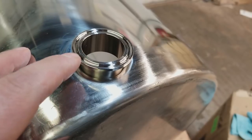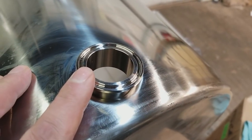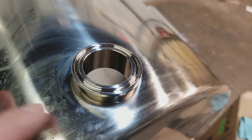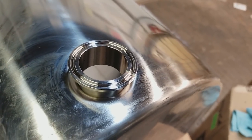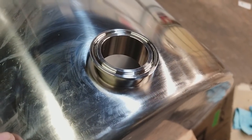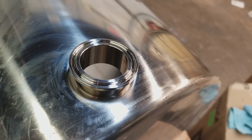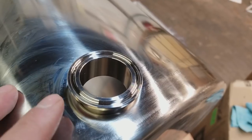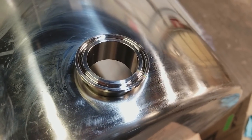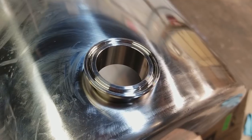This is what I'm calling the one-step pull-in process — you are pulling the ferrule in and making the dimple in the wall of the pot at the same time. There's also a method where you pull the dimple out of the pot first: you load the tool in the opposite direction without the ferrule, flare the pot outward, then reload the tool backwards so the ferrule gets pulled back into the pointy part of the flare. It's a more challenging install method that some people think looks better on the outside, but I think it's not worth risking damage to the pot. If you've got a scrap pot you want to try it on, not a big deal — the ferrules are four or five dollars so you can experiment.